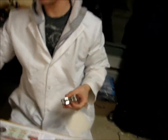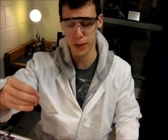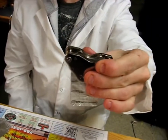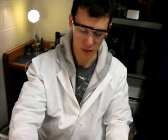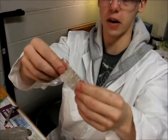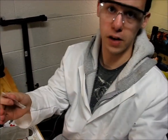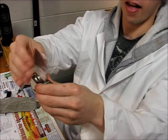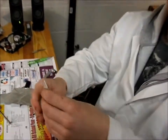What we're going to do is drop some aluminum foil through the gap — this works with any metal, but we have aluminum foil so we'll use that. When you drop it through, you'll notice it falls a lot slower. Why? The magnetic field induces a current into the metal, and any metal with a current has its own magnetic field. The two magnetic fields then repel each other, causing the foil to move much slower.